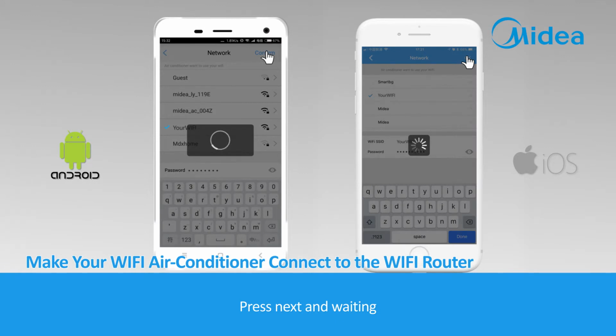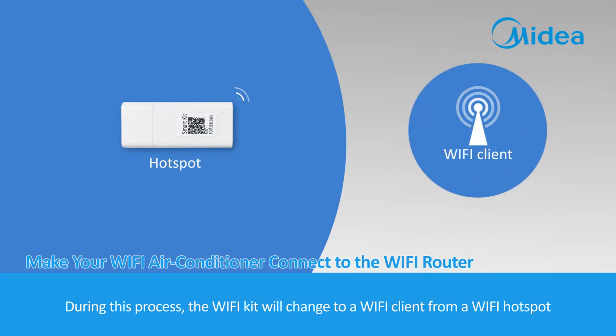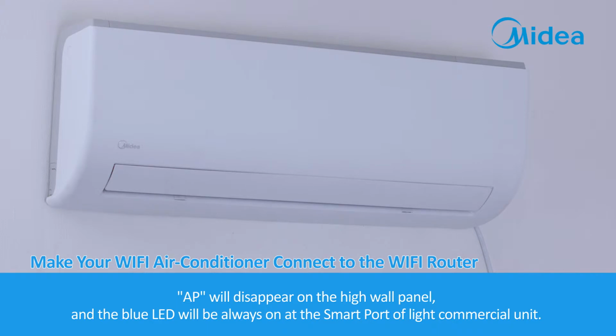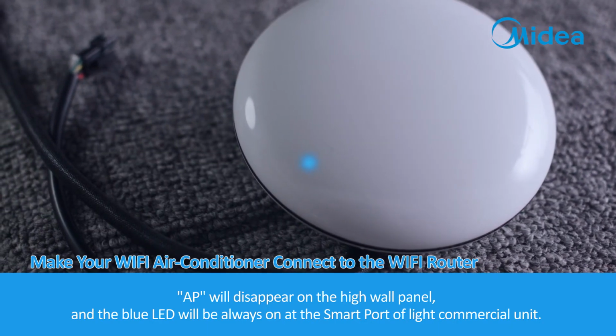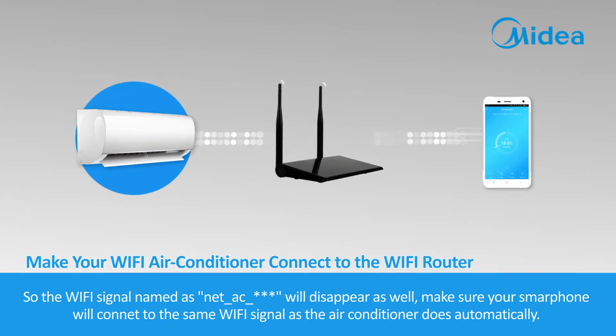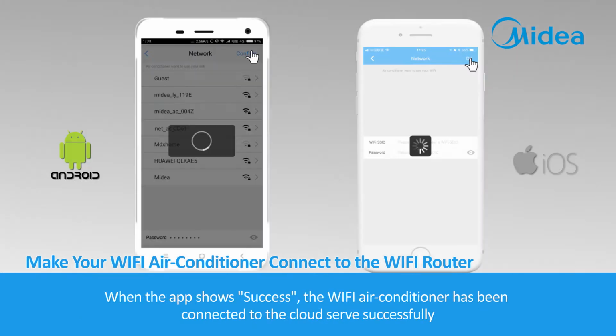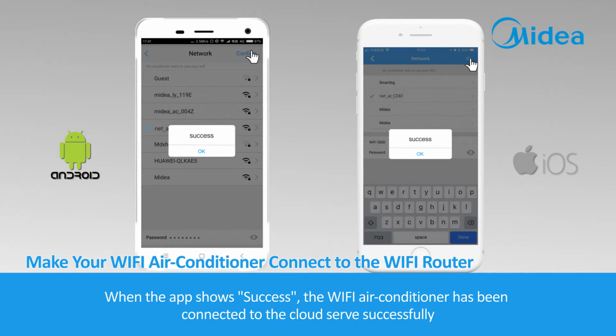Press Next and wait. During this process, the Wi-Fi kit will change to a Wi-Fi client from a Wi-Fi hotspot. AP will disappear on the high wall panel, and the blue LED will be always on the smart port of light commercial unit, so the Wi-Fi signal named as net_AC_ will disappear as well. Make sure your smartphone will connect to the same Wi-Fi signal as the air conditioner does automatically. You'd better make your smartphone forget other Wi-Fi connections and maintain the only Wi-Fi connection that is used for Wi-Fi air conditioner. When the app shows success, the Wi-Fi air conditioner has been connected to the cloud server successfully.